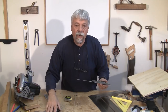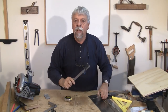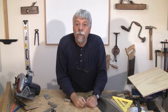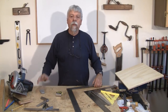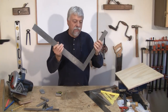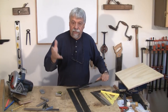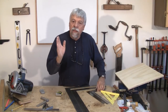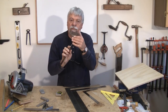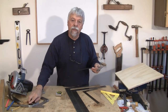I love the tool, and I use it from time to time if I don't care how accurate it is. They come with different attachments, and I use them all from time to time. So the tool does have a use, you just have to be careful where you use it. So what do I use? Well, I use the old reliable, being around for decades and decades — an old reliable steel square. This is a 24 by 16 inch steel square. I actually have two of them. Then I have two smaller ones — this is a 12 by 9. This is a small flat square, a lot easier to handle, and far more accurate — always far more accurate than a tri-square.